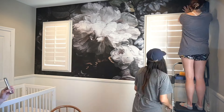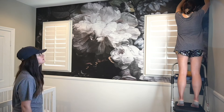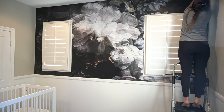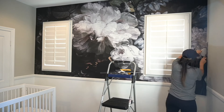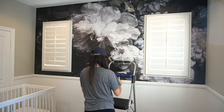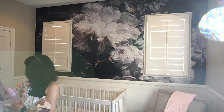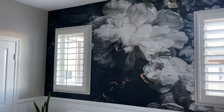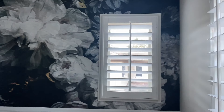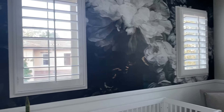For the last piece it went up just as easily. It was really important that we gave the wallpaper company accurate dimensions — when we ordered, they recommended ordering wallpaper that was four to six inches wider than our wall so that we had a two to three inch buffer on each side and at the top and bottom. So if you're ordering wallpaper, make sure to give yourself about four to six inches on the width and the height so you don't run into an issue where you're short. I know this tutorial was shorter than my normal tutorials, but I just wanted to give you a brief overview of the process to give you the confidence to tackle your own wallpapering projects. Leave your wallpapering tips in the comments — I'd love to hear them. Hopefully this tutorial gives you the confidence to tackle wallpapering projects, because it was a lot easier than I thought. Thanks so much for joining me and I'll see you in the next tutorial.